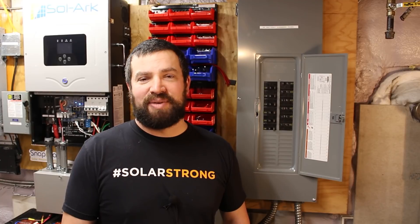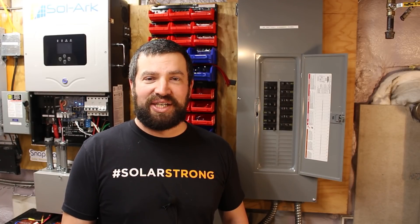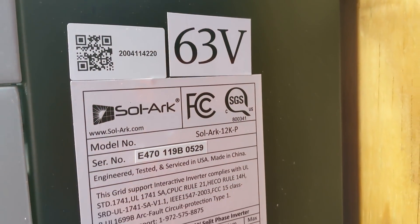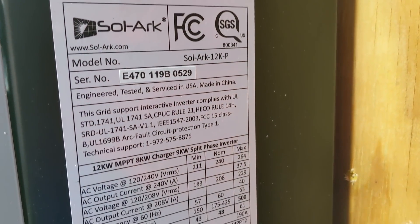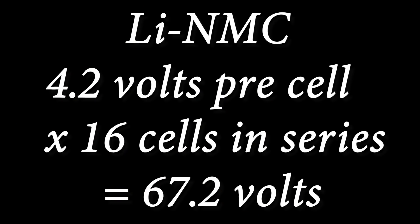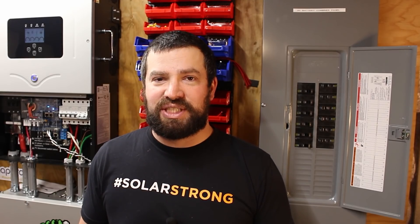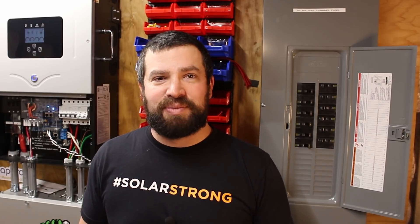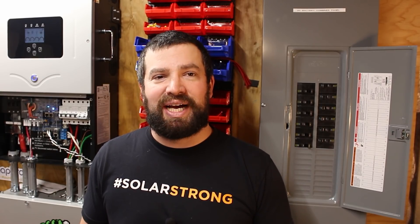There's no active cooling of the batteries because I just don't need it — they don't even get warm when I'm charging or discharging. My inverter only goes up to 63 volts, and with a 16S NMC pack you could go up to 67.4 volts. So I'm not able to use those top few volts, but that's okay because I get most of the pack.